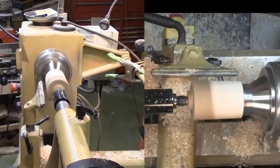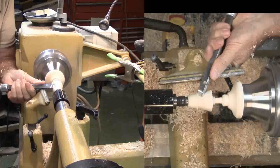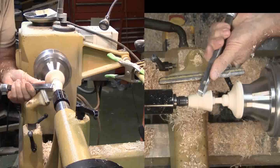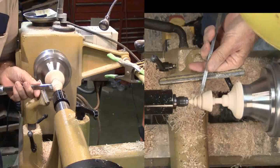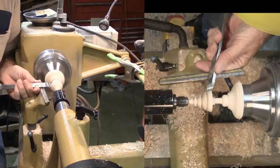And finally a tree for inside the ornament. This is a lot like my tree of a couple weeks ago, only smaller. Here again my tool of choice is my smaller skew after roughing it with a spindle gouge. Then establish the tree height to fit the ornament, then shape the trunk and foliage with the skew, and sand and finish the tree. Assembly is gluing the tree inside the ornament, gluing on the bottom finial and hanger. And my inside-out ornament is finished.